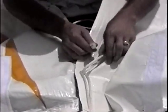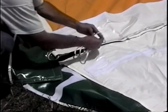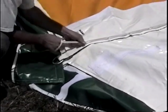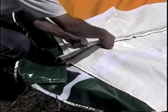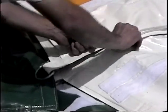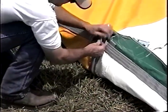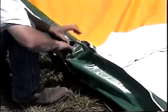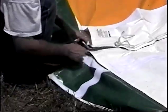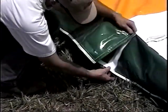If your tent has quarter poles, 61 foot and wider, watch for the hook ring set at about the halfway point to be connected and not overlooked. As you finish up lacing, tie off at the end with any simple knot. Be careful to connect the hook ring set at the bottom edge of the tent. Now close the valance by pressing the Velcro firmly together.